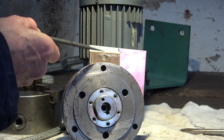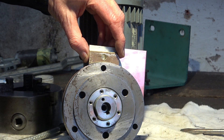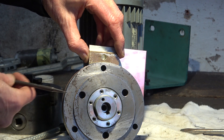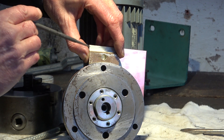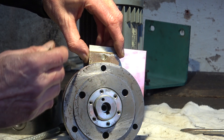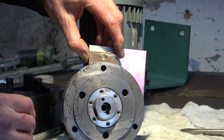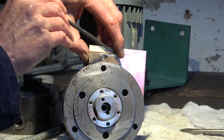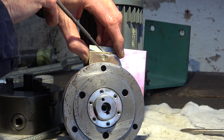This curved surface here isn't intended to rub against the side at all — I'll bring it off a little bit. That's where the cable will go through from underneath, from the backside. What I'm planning to do is to solder this to this copper sheet, and being soldered and curved like that it'll give the sheet some strength in that area. Once I've got it soldered on I'll cut all the excess copper off, then drill and tap for a grub screw to clamp the cable.